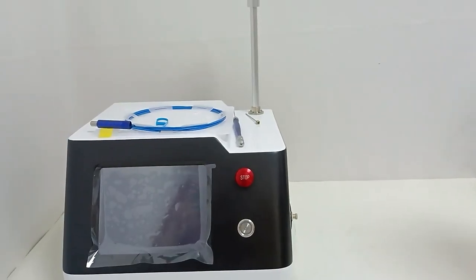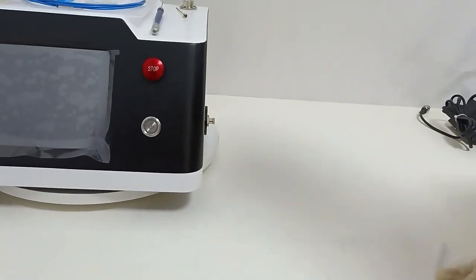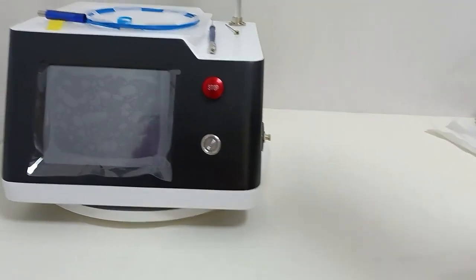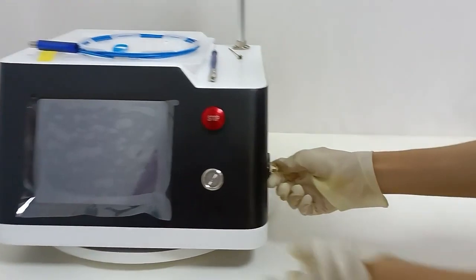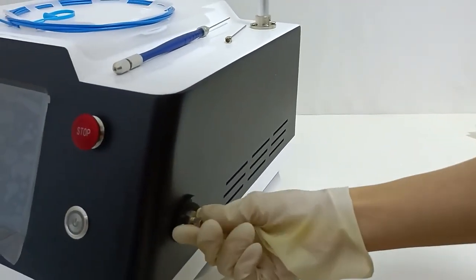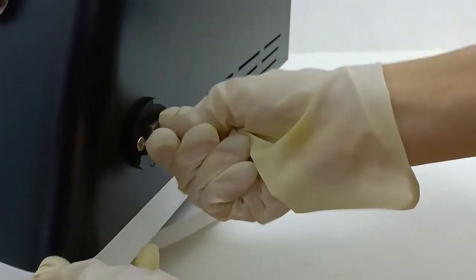2. When replacing the surgical optical fiber, make sure that the surrounding environment is clean, and operate in a dust-free environment as far as possible. Wash and dry your hands, and quickly replace them. In this process, there should be no dust pollution to the laser and optical fiber port. If there is dust or stain on the optical fiber port, the optical fiber head must be wiped clean with professional optical fiber wiping paper or cleaning cloth.